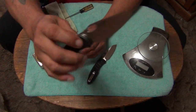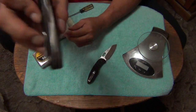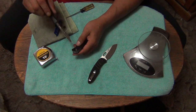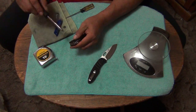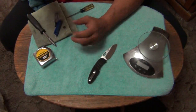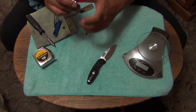To get to this screw - this is your pivot screw - use a flat tip to tighten or loosen it. I can just tighten it up right now. You can see how it's off center. If I take this and just tighten it up - right there - it centers it out. Now it's perfectly centered. But if I just left it like that and put it all back together and went to flicking and fidgeting with it, it would just come loose again. The blue Loctite does not hold - it really needs to be like a D-shaped pivot screw.